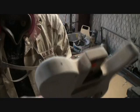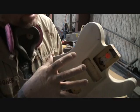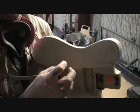But hold on, we're not done yet. I was telling you about Clorox. I was telling you that I was gonna bleach this wood, but this wood is so clean that it doesn't need bleaching. A lot of times if your guitar is stained instead of painted, what you wanna do is take some Clorox with some fine steel wool and Clorox that wood down. What that does is bleach the wood and pull out all of the impurities that are inside it.